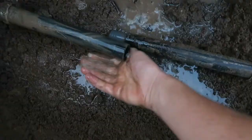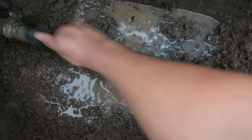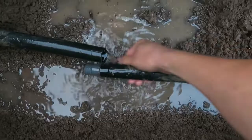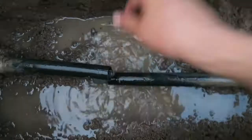Some water in there. Nice thing about poly pipe is your pipes don't have to be really that clean at all — the only real connection surface is on the inside. But it's always nice to work with clean pipe. PVC on the other hand, you've got to make sure it's clean and dry so your glue has good adhesion.